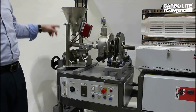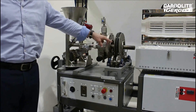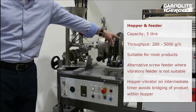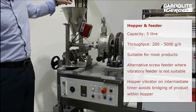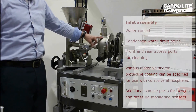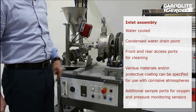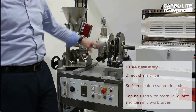We're now looking at the vibratory feeder, the inlet assembly and the drive system. The vibratory feeder is the industrial type with two vibrators: the main one which transfers the product through the tube and into the work tube, and the secondary one which ensures that the product from the hopper flows down into the primary feeder tube. The inlet assembly is water cooled when operating at temperatures above 900 degrees C, with twin silicon rubber seals and exhaust vents and collection traps.